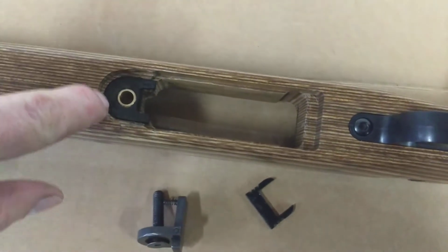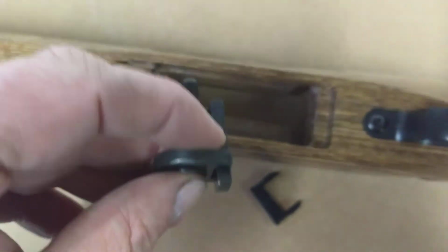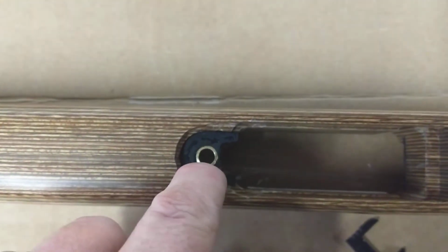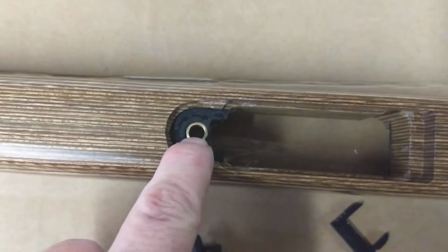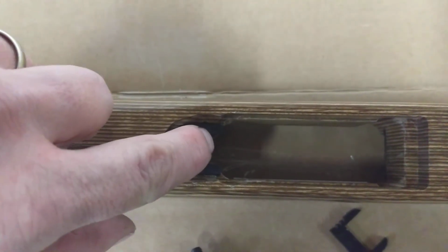And then the swing latch mag catch for this up front will be essentially the same as this part, but will be a little smaller footprint and share footprints with this little plastic bit. That way you guys don't have to modify your stocks like this. So it's basically a bolt-in. The only thing you'll have to do is, the customer had already done this when he sent it to me, just clearance this little plastic tab.